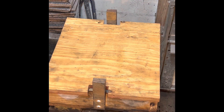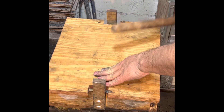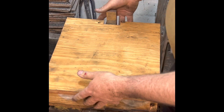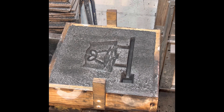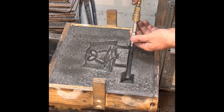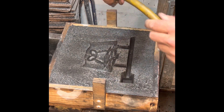It's flipped over. I rammed that on the bottom board so it'll stay exactly where it's at. Gently wrap it — that's a piece of inch and a half dowel, probably an old broom handle. Here I am pulling the pattern. You can see I've got a very clean pull. One of the things you notice when you lay out your pattern: you always put your splash well away from you. That way when you flip it, you end up with the splash well facing you.